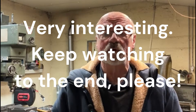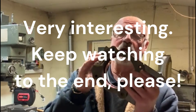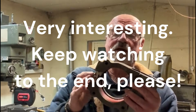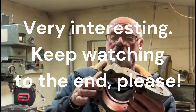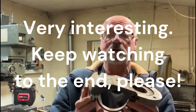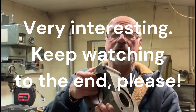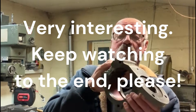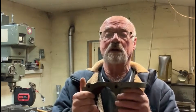A project I have on today - I've got this great big cast iron thing. This slot here is quite badly damaged. I've had to weld in some cast iron using cast iron welding rods to fill up all the holes where it's all broken and disfigured. I'm going to mount this on the milling machine so I can machine this slot and clean it all up to get this thing back into production. I'll have to drill the holes as well and re-tap them because obviously you're going to have to fill all these holes up with welds.